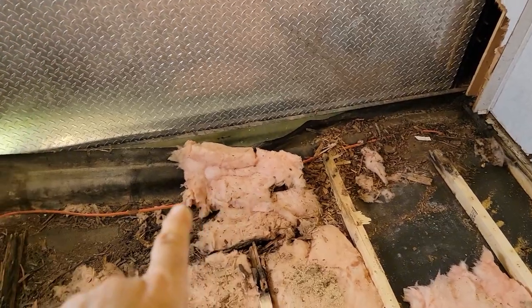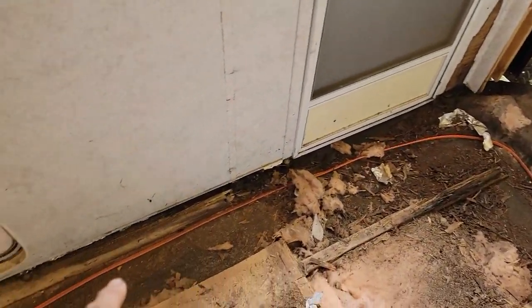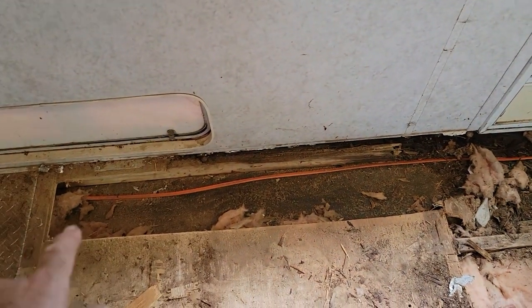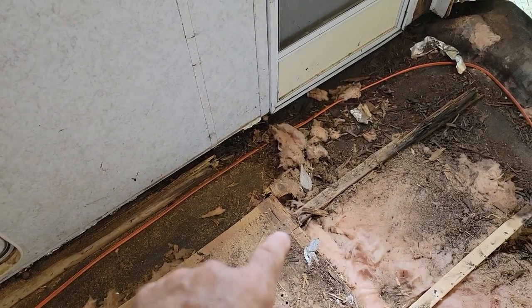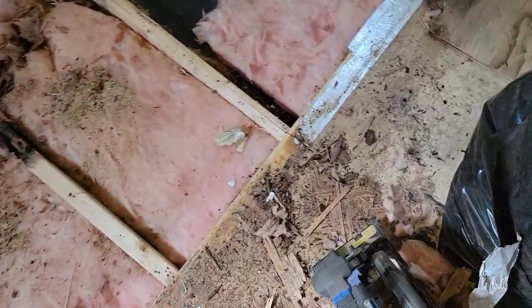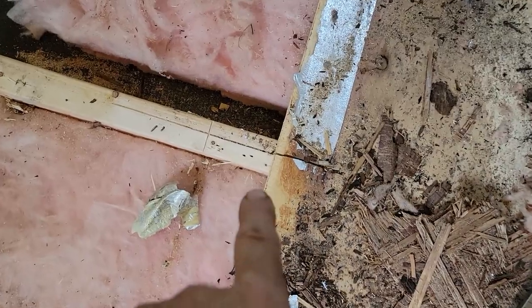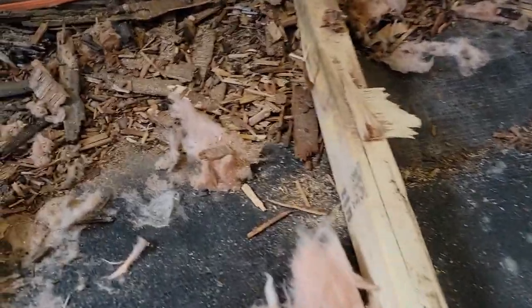When you're cutting, you have to make sure you watch out because there is a power line running in here. This looks like it's probably your AC line — being that orange color, that's probably the AC. That's why I set the saw blade so it just barely goes through the plywood. You can see down here I just barely cut into it when I cut through there, so it didn't go through very far, just enough to make sure it cut.